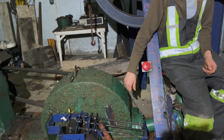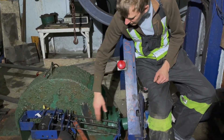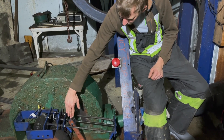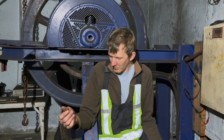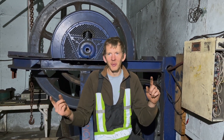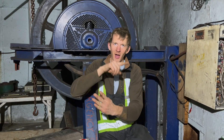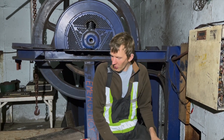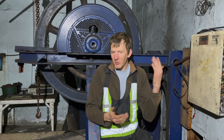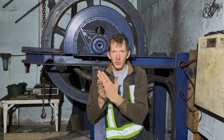With our controller here, when I wired this back together, I assumed that our safety switches on either end — the arm comes over and hits the safety switch and stops — I assumed they're just a switch that turns on and off. But apparently they've got diodes in them. So when they activate, it won't let electricity go through one way but it'll let it go through the other way. So it stops, but you can still back it off. What happened was because I put them in reverse, it would hit the switch and not only not stop, but just keep going — and you couldn't stop it. So it tried to smash itself apart.